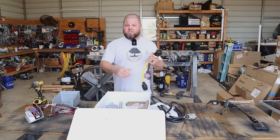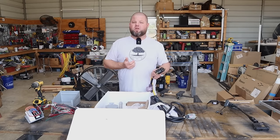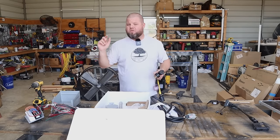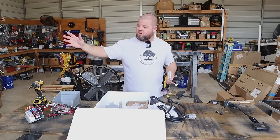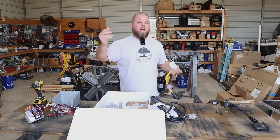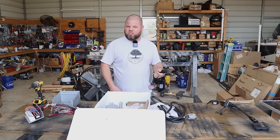The beauty about doing this is should you upgrade generators down the road or have multiple generators like we do, you can wheel a 240 volt generator right over this transfer switch, fire it up. You can use that 240 volt breaker in there to power a 240 volt appliance in the house if you want. And you can roll that right back out, roll your 120 volt generator up there and power things in your house such as freezers, refrigerators, window units, things such as that.